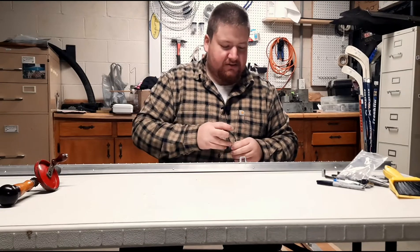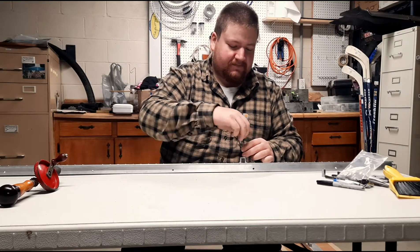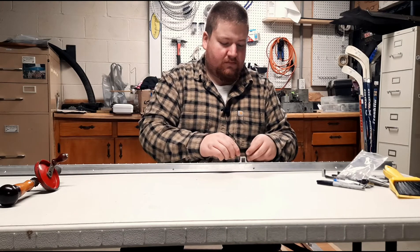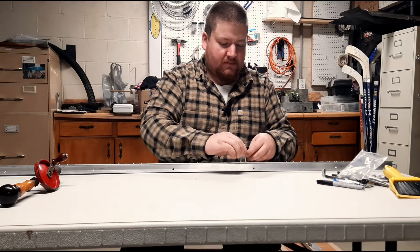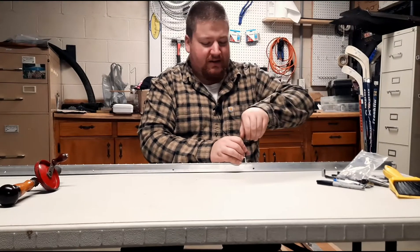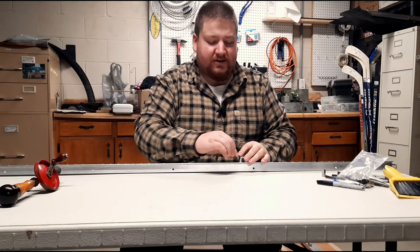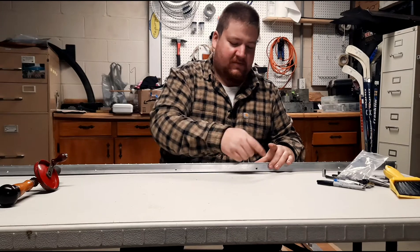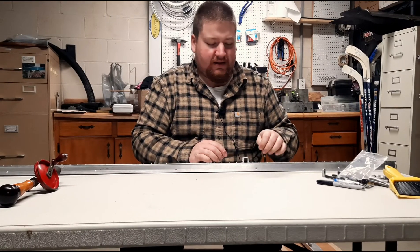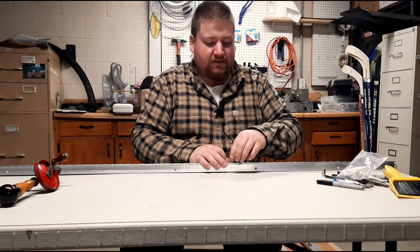You may have noticed I am wearing an external microphone here, so hopefully the audio quality is just that much better for the video. I am definitely not a professional filmmaker by any means — I just do this as a hobby. And if you don't like it, it was free. Although I do try to make these videos nice and enjoyable to watch. These screws don't need to be incredibly tight — they're not holding on a whole lot, and the threads are just in aluminum. I believe I said 6-32 earlier; excuse me, it's a 4-40 thread. That's pretty thin and it doesn't hold a whole lot of torque, especially in aluminum.